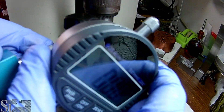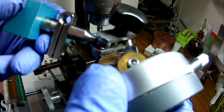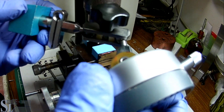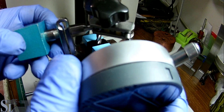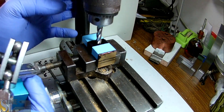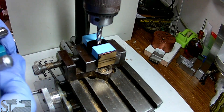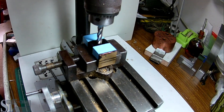I'm using this digital indicator with a fixed magnetic mount. You can't use on a Unimat the on-off version of a magnetic mount because of the base. Basically, I'm using the pole over here. The top is simply just too thin and small for the larger magnetic mounts.